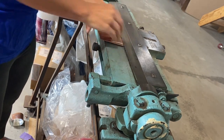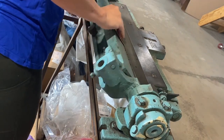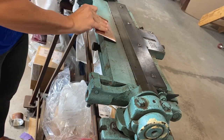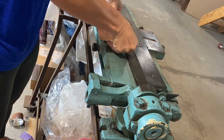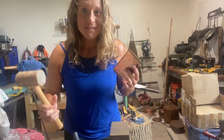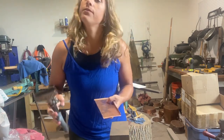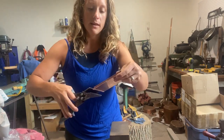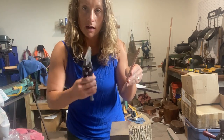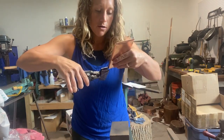You really want to get these flanges underneath, or they'll slip out on you, and that really sucks. Back to the bottoming stake. As I've said before, if the length of space allows - and actually this one may work because it's the cover and slightly bigger - you can use one of these instead of a bottoming stake if you don't have a bottoming stake.